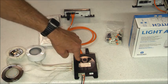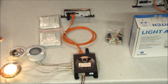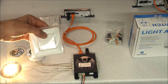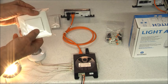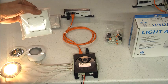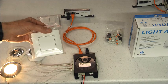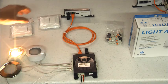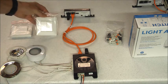We press and hold the learn button, which takes us to the first channel ready to learn its switch pairing. I press the top rocker for on — it receives the signal and goes steady to confirm. Then I press off, and it goes back into learn mode, ready to accept more switches — up to 128 switches if you wanted three-way, four-way, or five-way lighting. We go on to channel 2, program on and off, and that's programmed.